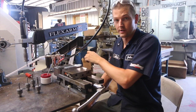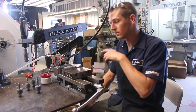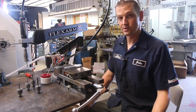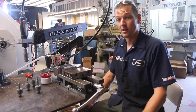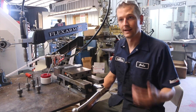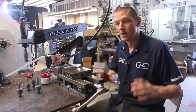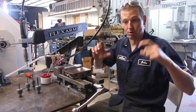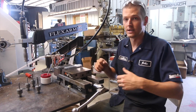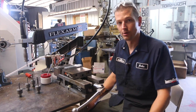What I'd rather do than just continue this video is show you how we use it when we do job shop stuff, Wednesday widgets, other projects like that. We would not run taps that deep on the Tormach, and when we get a VMC I'll be curious to see if that changes. Thread milling is another thing — I love thread milling — but you're talking about a hundred bucks for a thread mill, plus machine time. We've got a fixture plate we make for Windfire Steel where we hot-swap them. Jared pulls one off, taps those holes — they're already on a fixture plate. It'll be way faster while the other plate runs all the milling and drilling ops.